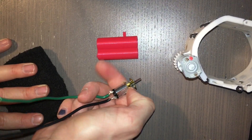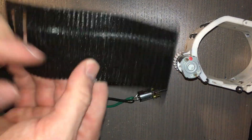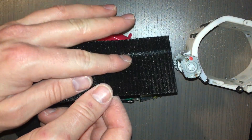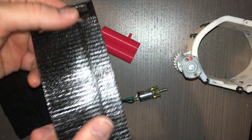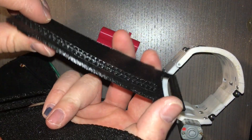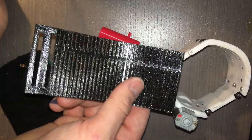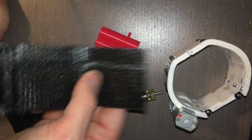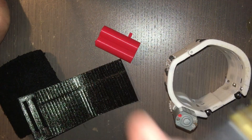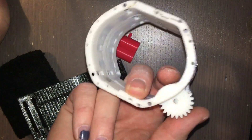I finally got the belt as thin as it probably was ever going to get. What I did was extend the belt pattern all the way across so that it would add more flexibility, and I decreased the thickness quite a bit. You can see here's the original thickness — we went down a lot. This is pretty rigid and thick, and it sort of worked but also sort of didn't, not without some help. I was cranking this up to like 9 to 10 volts when it's only rated for six. So I put my foot down — this was not the way to go. I replaced the motor, and this bigger motor works.